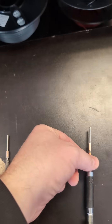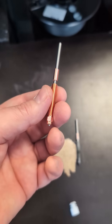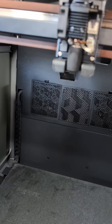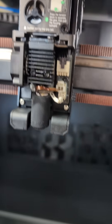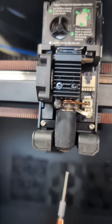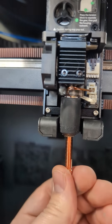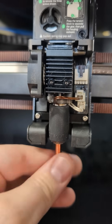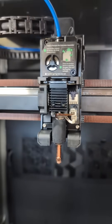You can actually just use a quarter inch driver for these particular nozzles — really convenient. I've got a light application of thermal paste on here. You're going to want to go ahead and push in the cutter on the side here, and that'll eject any filament that's in the way. Go ahead and put the nozzle up through the heater block and start threading it in. There's a lot of threads, so I'm going to do this by hand and finish it up with the actual driver.